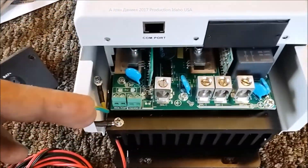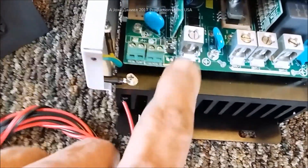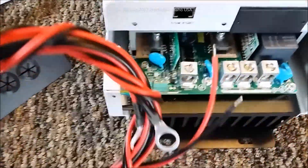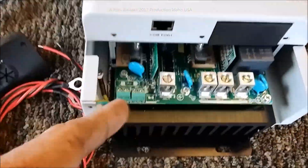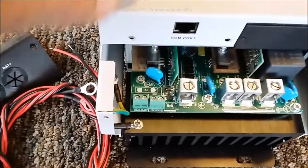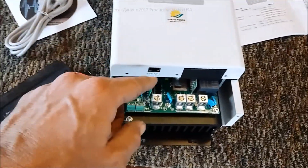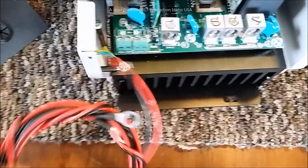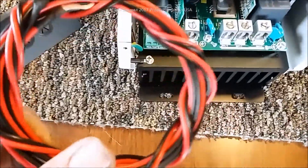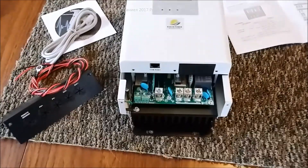With this front cover off, you can see down here the voltage sensor and it has a battery temperature sensor port. These units do not come with a battery temperature sensor, however if you look up a Tracer battery temperature sensor — it's the same identical one — you can order it for $21 from them or for $6 elsewhere. I'll put that link in the description. This is what the voltage sensor connects to, and it drops down to your batteries so it senses directly from the battery — not from the pushed voltage on the controller end.